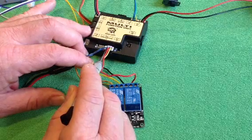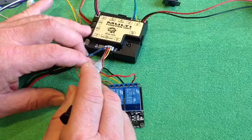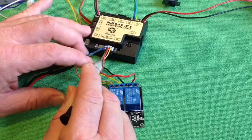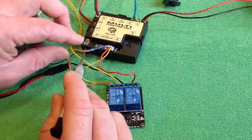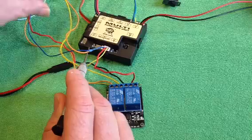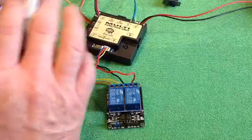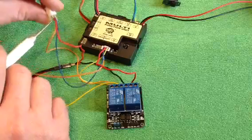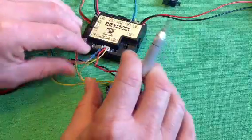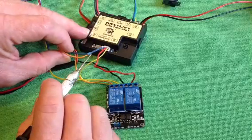To provide positive power to your headlight, to provide power to your hull machine gun, and to provide power to your turret machine gun. As you can see, it's split here - that gives me two connections, and if we follow it up, this blue wire here has a third connection coming off here. You can do it any way you like. This pin needs to be split into three to go to your three LEDs.